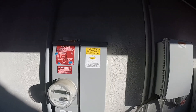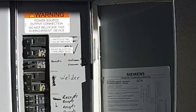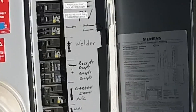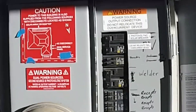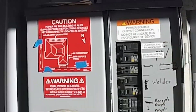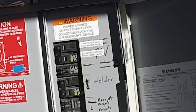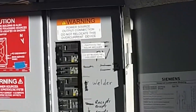I'll show you the inside. You need a two-pole breaker where the solar comes into the panel, and that breaker has to be furthest away from the actual main service. In my panel it's in the center, so as far away as I can get is where the solar comes in. You can see the other required stickers on here as well.